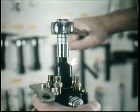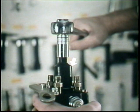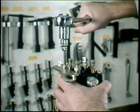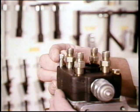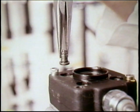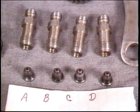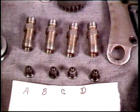Use the special socket tool to remove the central screw plug. Remove three retaining screws from the distributor head and remove the bracket. After removing the bracket gasket, reinstall one screw in the distributor head. Remove each delivery valve holder with its own wear washer and spring. As you remove the delivery valves and gaskets, keep each set of delivery valve parts together so each set can be reinstalled in its respective outlet when you reassemble.